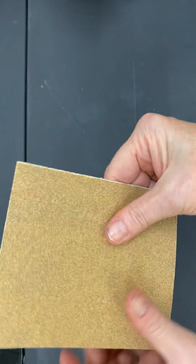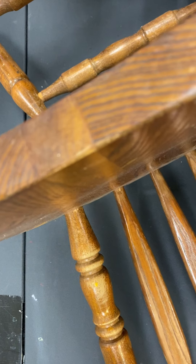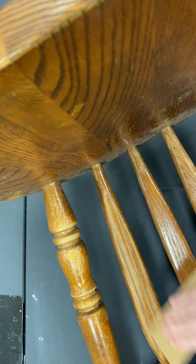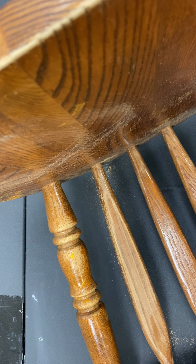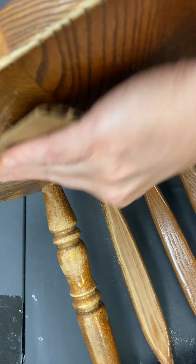So that's if your chair has no major finish or paint. The next type is a medium grade — a regular rough surface. This type is best for a chair that has a finish. This is Ryan and Jacob's chair. It's kind of hard to see, but they have a heavy finish, and a lot of the chairs do. So you're going to get that medium sandpaper and try really hard to get all that shiny surface off. You're going to sand in that circular motion or a back and forth motion. When you get to the legs, you're just going to go around and up and down, then circular motion.